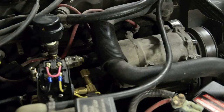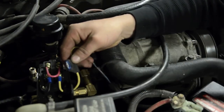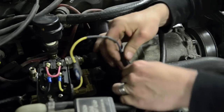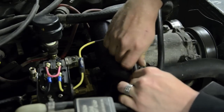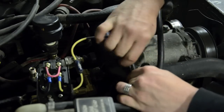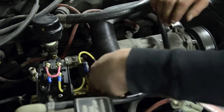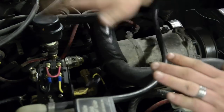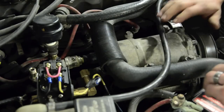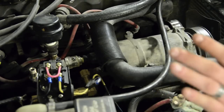Right after that I put my fuse in — very important to have, you don't want to blow anything else out. And just to make it easy, I put it on the factory plug for the air conditioning compressor. The beauty of this whole circuit is you only have to run a power wire. The magnet on the clutch of the compressor is grounded, so no need to run any ground wires.